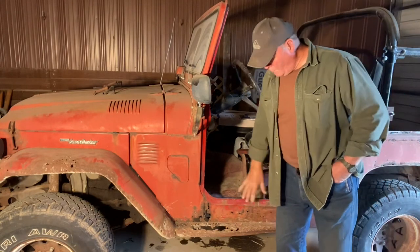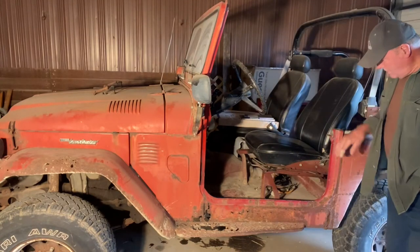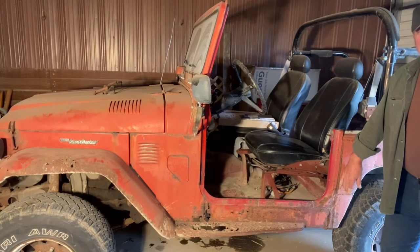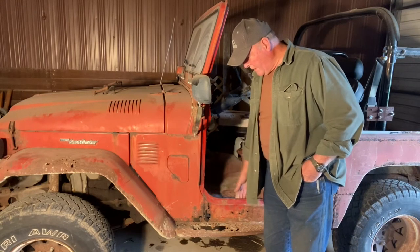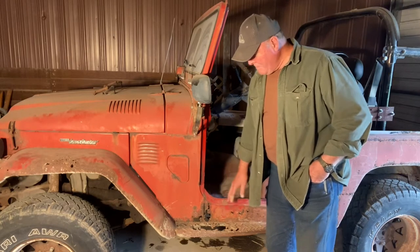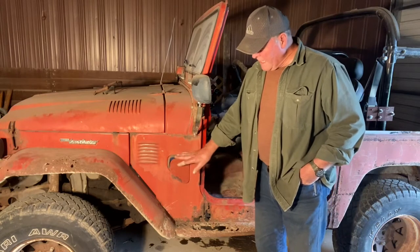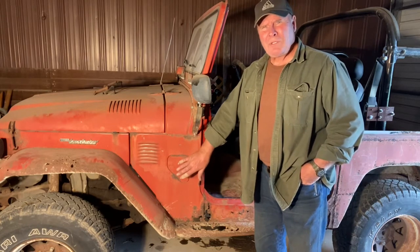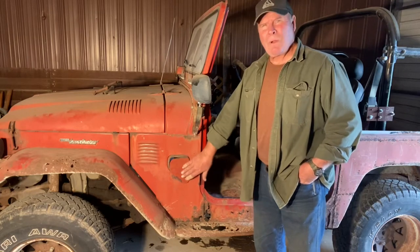In the meantime, there are a few small projects I thought we could knock out. One of which is the rocker panels here, both inner and outer. I may also have to fabricate this B pillar right here, because the half tub comes to this seam right here, and I don't believe the B pillar is involved in that. There will be some rebuilding of the A pillar down at the bottom where the rocker panel goes into that. But one of the easy ones for today was this little vent window here, or the vent door. So I think what we'll do today is knock out the paper templates, get a wooden buck made, get the sheet metal cut out, maybe even get it all hammered out today. We've got to get the right measurements and everything for it — that is where we will begin.